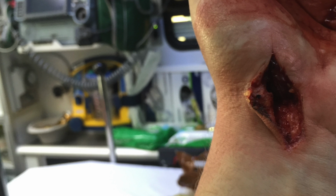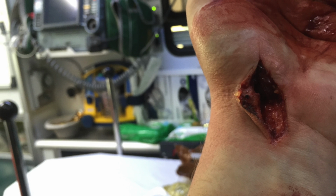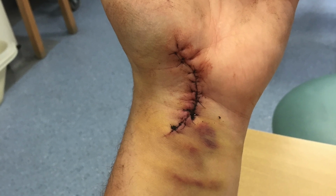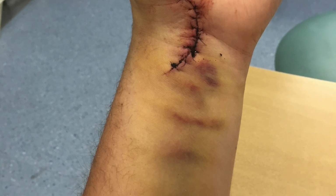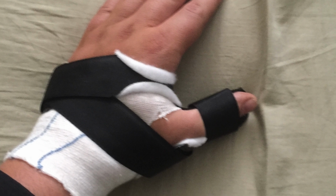So in hindsight, it was extremely lucky, and I tell you now, once bitten, twice shy. Now, whenever I'm cutting metal or using an angle grinder to take the paint off, I always make sure to use the correct disc on the angle grinder. I don't wear gloves. I make sure my sleeves are pulled up, or I take my jacket off first, and I for sure use a vise.